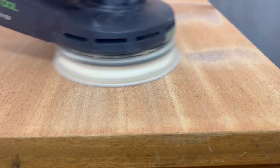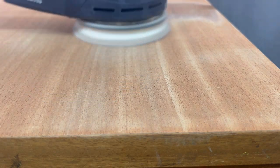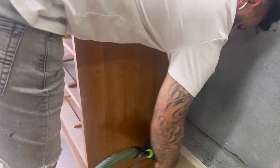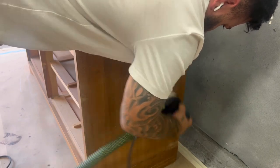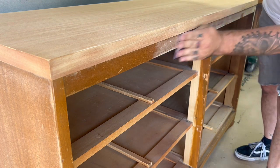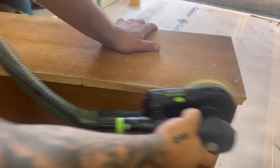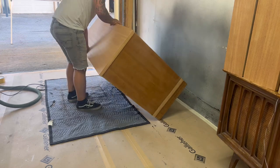I do still recommend wearing a mask. I'm taking this down to bare wood because I plan on staining the top in a dark walnut color — you guys already know I love my dark walnut stains. This piece is from the 60s and the veneer has softened up a lot over time. I know I'll get some flack for this, but I am doing a two-tone paint and stain combination. Some of the drawer fronts had very thin veneer at the edges, so any spots I blew through I touched up with a pen. The drawers also had a deep groove from a screw sticking out of the track, so I had to bondo that and decided to just paint most of the drawers, which you'll see later in the video.